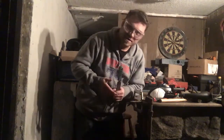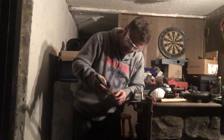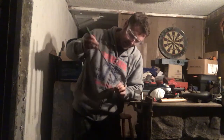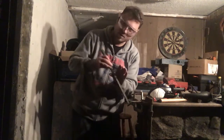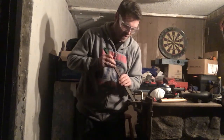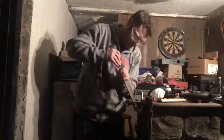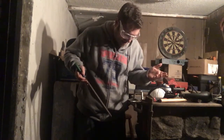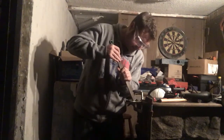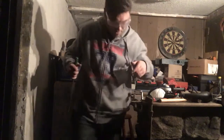Now the one thing that I did see from YouTube, and that's the idea that I keep looking at YouTube videos and then coming back, is that with the files, there's one way that it's actually got a cutting side, and that only goes one way. So if I'm to go up, down, up, down, it's really just wasting energy. If I just go in one direction like that, I get as much work done but with less energy. So that actually has worked quite well on that side. Just do a little bit more, and then I'll jump around the other side. Do this side too.